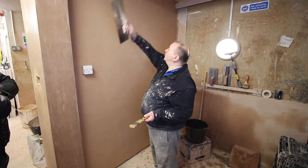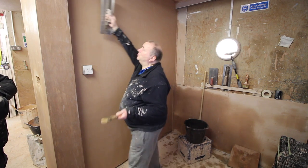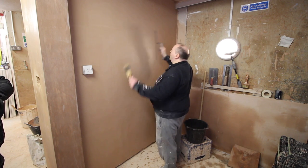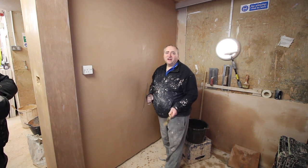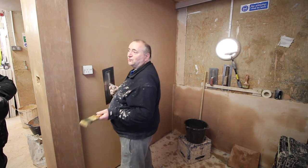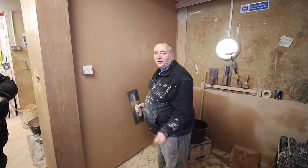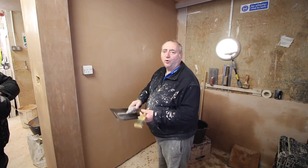So this time you can trowel it across the way if you wish, if you can reach both sides. So basically you're just going to be coming from this side, halfway and off, and coming back, and just overlap them. Just bring it that way, and then give it another 10 minutes and then get a first polish. And that's it. So basically steam again, bring the top down a wee bit and then just work your way across and all the way down to the ground. Leave it another 10 minutes or so and then it'll be time for a polish.